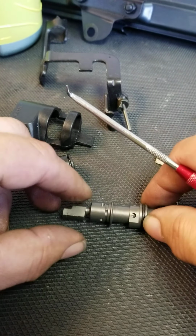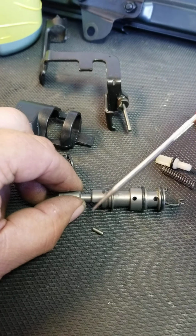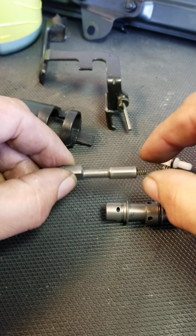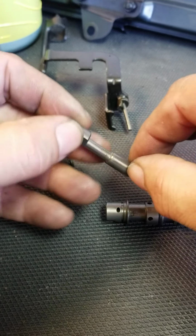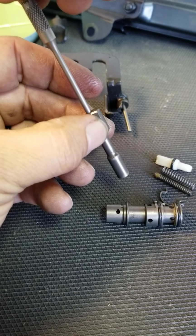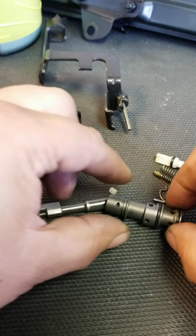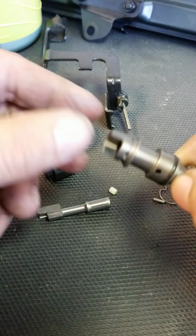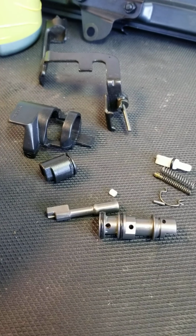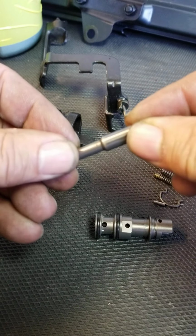What we have now is the lower bushing. You can slide a pin out. That pin right there is holding rod A in, and then inside rod A there's a spring and rod B right there, that urethane piece. And you can change these O-rings. That's all the lower portion of the bushing is, and change out whatever you need to be changed out and put it back together.